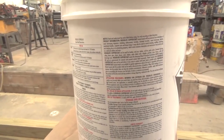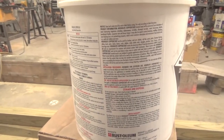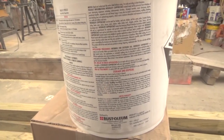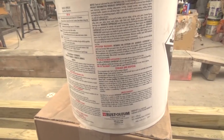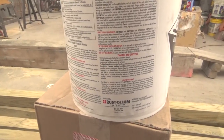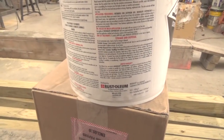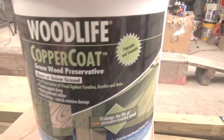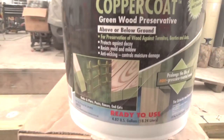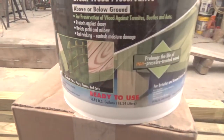They claim it's good to apply over fresh cuts in wood, especially treated wood — even regular wood. You shouldn't spray it or create any fine mist with it. This is five gallons, so it should cover about 1,500 square feet. There's a limited warranty but it doesn't specify a time period. It is paintable and stainable, and it's recommended for decks, piers, posts, fences, and end cuts — which is exactly what I originally got it for.